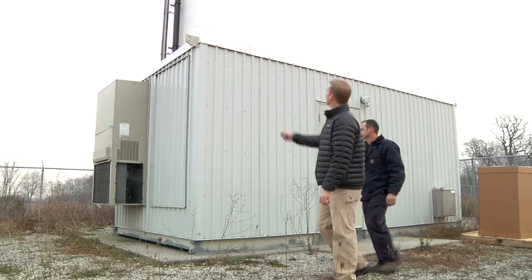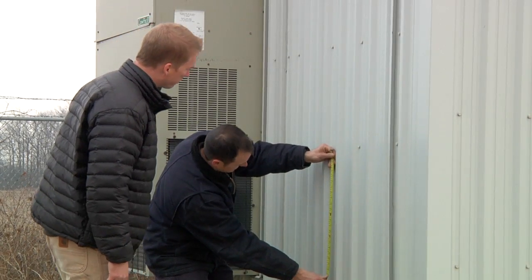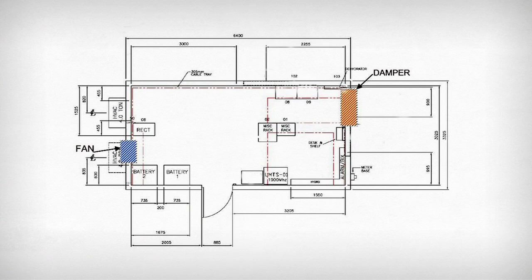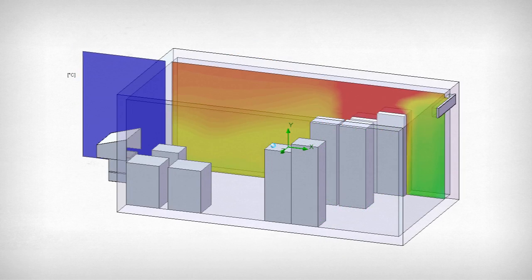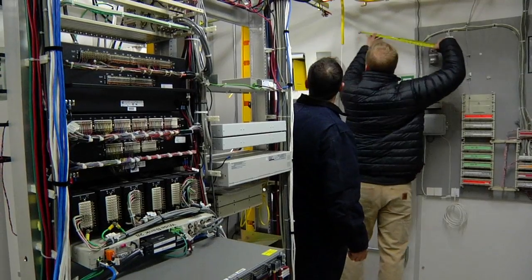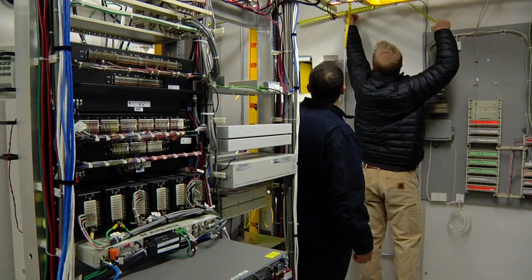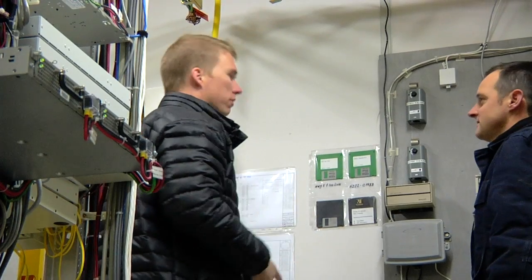Begin by reviewing the site and checking for interior and exterior obstructions prior to determining a location for the components. Additionally, make sure you refer to the pre-installation site survey as needed. Find the unobstructed airflow path for the fan unit. Make sure the location for the exhaust damper is placed as high as possible to the ceiling, and make sure that there is space for installation of the controller near the existing AC controller or communications board.